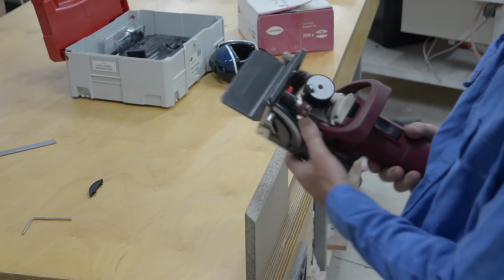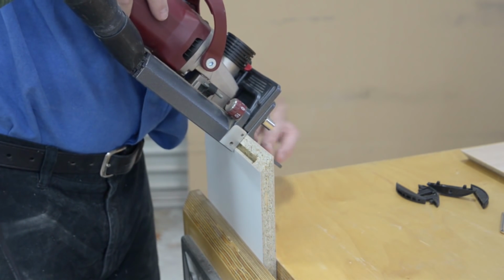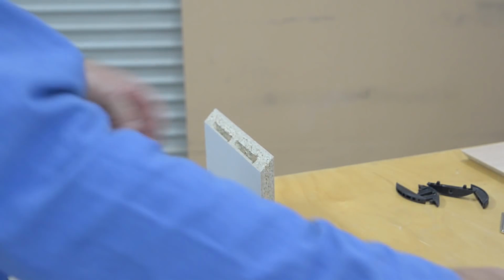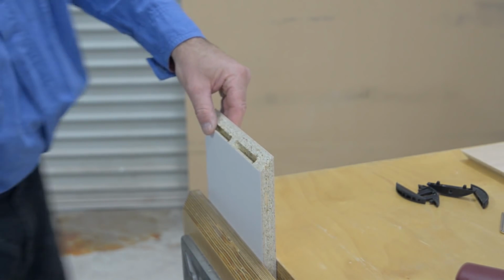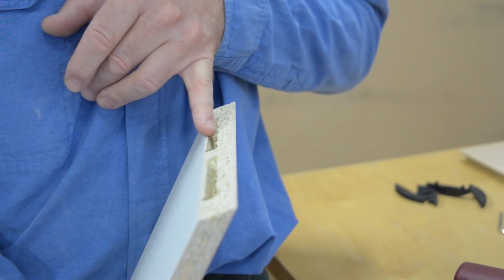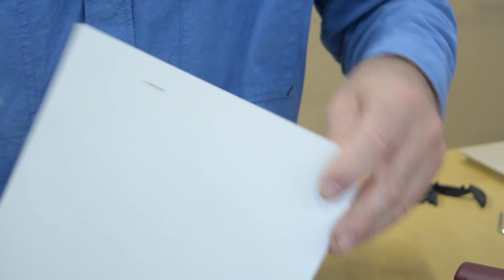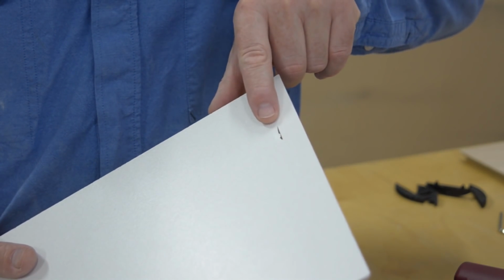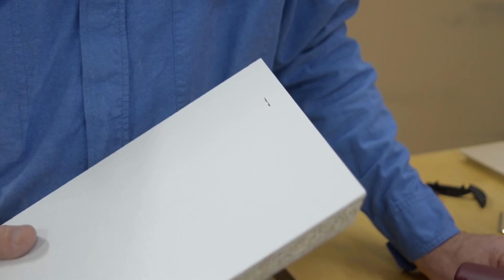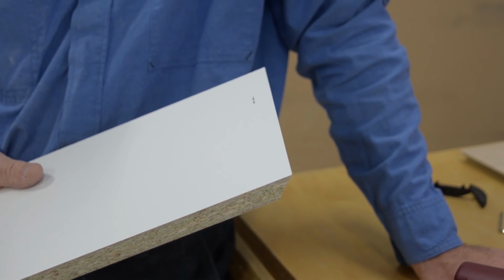Now we need a 14 for the Tenso fitting. Here you can see this was 9, this was 10, so my memory of 10mm was right, but I couldn't quite trust myself, and this is the result of overdoing it slightly. 9mm did that on a 16mm board, and 10mm is quite okay. So it would vary a little bit on the board, but this dimension set at 10 millimeters is basically your minimum on a miter, referring to the outside edge.